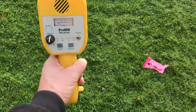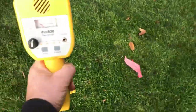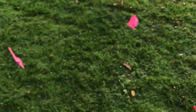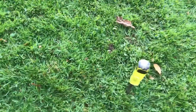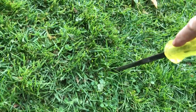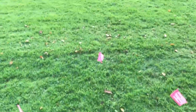I'm going to mark an edge there and see where it is — there, and there, and there. Hopefully I'm going to find my valve right in the middle. I've marked the outside edges where the tracer finds something. I think the valve box should be right there. I have a long screwdriver — that's what I use. It looks like it should be right in the middle. I'll start poking around and hopefully it's not too deep. There we go — it sounds like a box. Let me move it a little further over — there we go, right in the middle. Now we know where that one is.